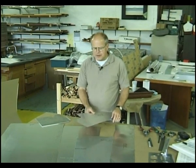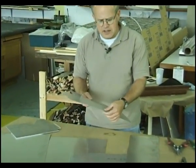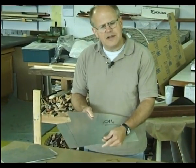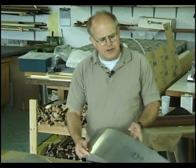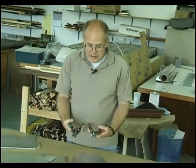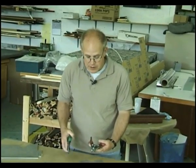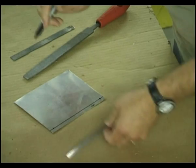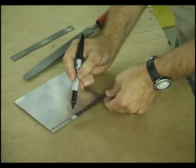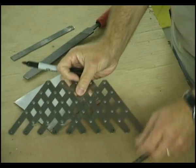Here are some examples of the various thicknesses. What I'm holding here is called 16 thousandths — that's quite thin, probably the thinnest you'll ever use in the construction of the aircraft. Here's the next standard thickness up: this is 20 thousandths, a little bit thicker. As for which choice of snips to use, it all depends on which is more convenient for you to make the cut — do you want the left side or the right side to curl up because it's the smaller piece?